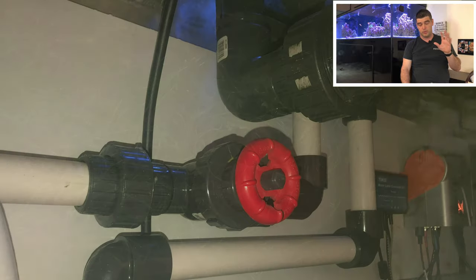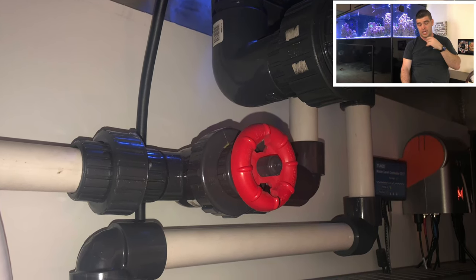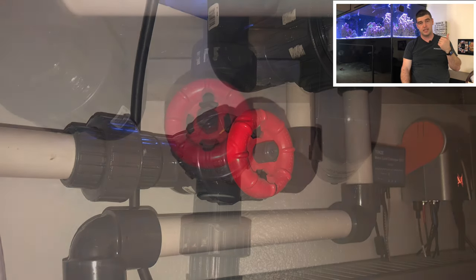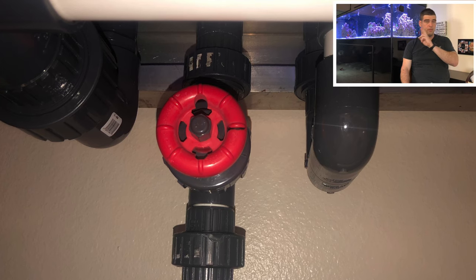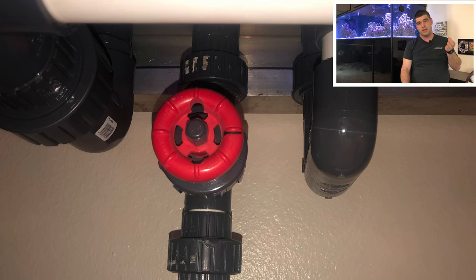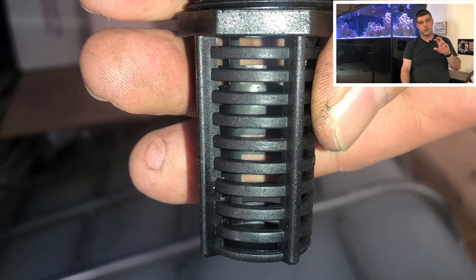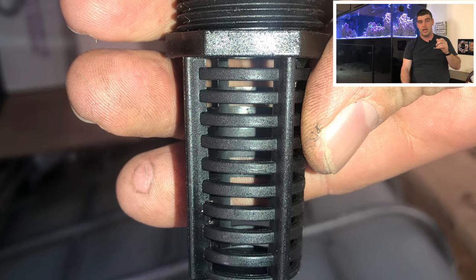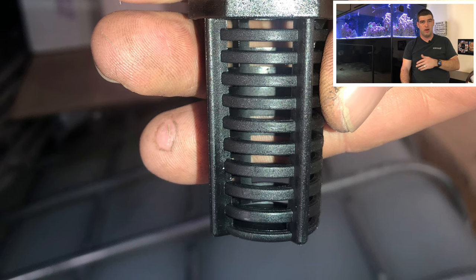The plumbing is probably one of the most important things for a reef tank — preventing leaks. I really like hard plumbing; it lets me build it in once and tuck it away. Good valves are much more expensive than what you get at Home Depot. Right now I have two overflow boxes, each with three holes: one return at one inch, one full siphon at one inch, and one emergency drain at one inch. The full siphon has a strainer to prevent clogging, and I can control the water level so almost no water goes through the emergency drain. I've already completely closed both siphon valves to verify the emergency drains can handle all the flow — and they can.